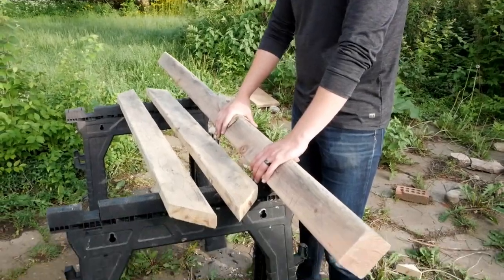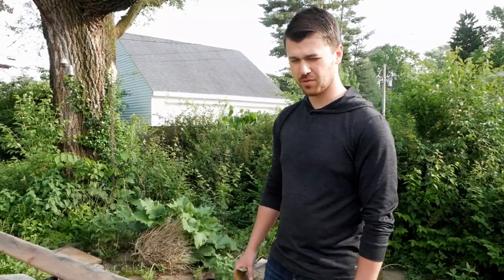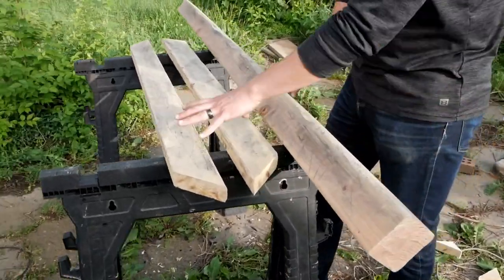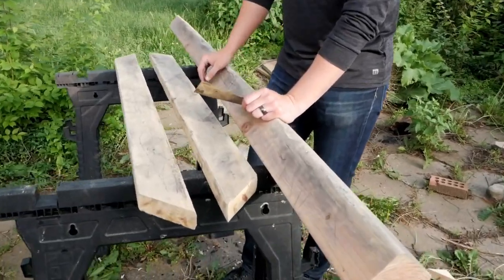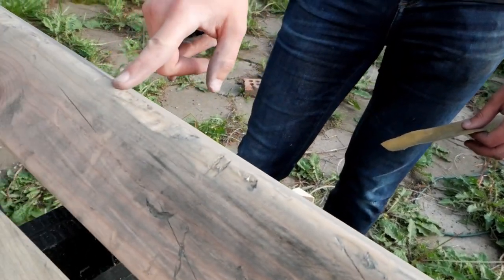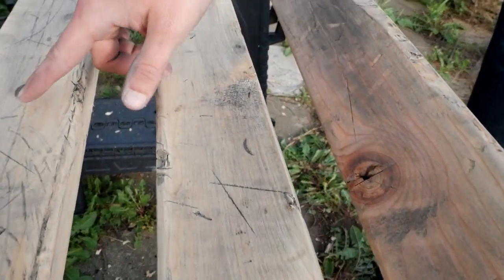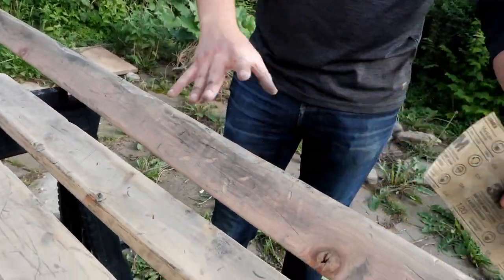Okay, so these are the boards we're using for the new Lark Shire backdrop set. This was super fun to do and not that hard. We went to Lowe's and picked up an untreated 4x4 post and an untreated 2x4 — all told about 30 bucks. We distressed them using a variety of things including a machete and a tire iron. We used the machete to make cuts in the wood as well as to take chunks out of the corners, just to give it that really weathered, broken-in look. The tire iron gave us these nice crescent dings and dents, and once we did that we had all this damage on the wood.